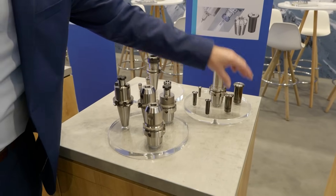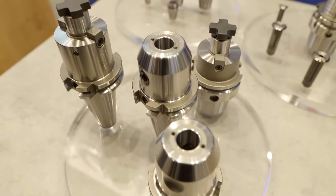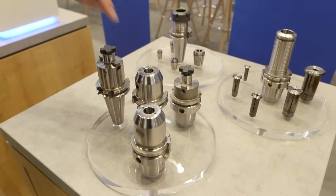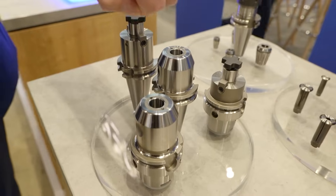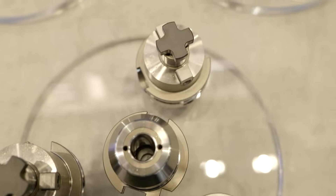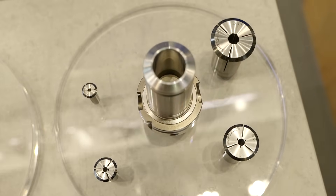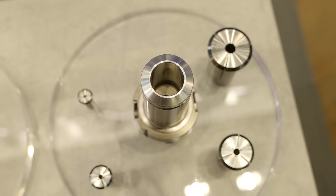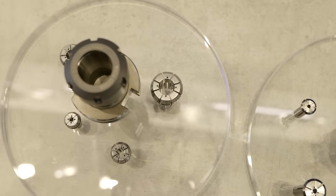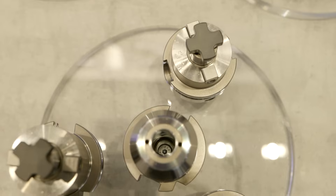Especially for very dynamic processes or where we have a lot of chips to evacuate. And we now offer it starting from this show for traditional machining — talking about milling arbors or shell mill tool holders — where you can see these two holes on the front side. If you want to use it for a drilling application where you'd rather use through coolant, you can seal these holes. There is a small thread in it, you can close them and use the through coolant of your drill. There is a lot of misconception with through coolant — it is there to cool your tool. But another problem this solves is that with through coolant you are cooling the drill, but you are not clearing the chips because the through coolant is just hitting the bottom of the part. The biggest problem with toolwear is when you are cutting your own chips. So with this system, it is there to clear the chips so you can run your tool to the maximum efficiency.